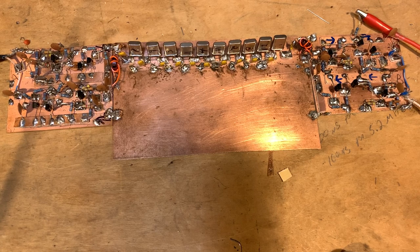A 10-pole filter might seem excessive, but I wanted to try to get as close as possible to the vertical skirt walls that you see on SDR transceivers that people are so proud of. Our crystal filters are normally like four poles or something like that and the skirts are quite wide, whereas on web SDR receivers you see skirts that are near vertical.